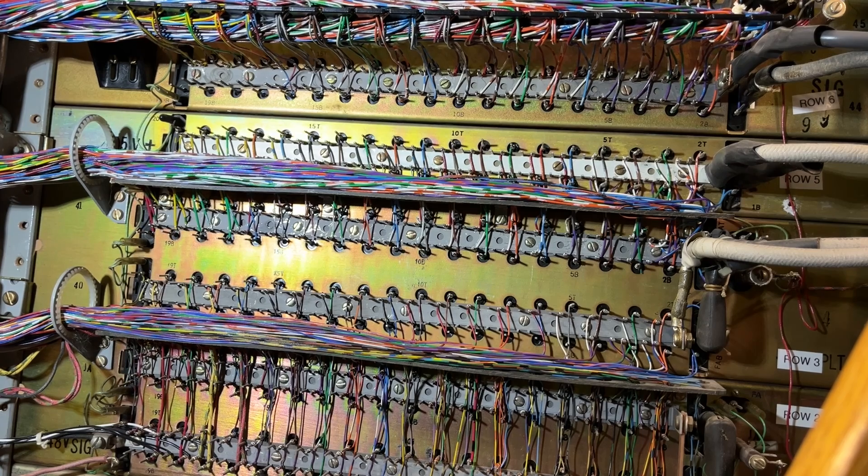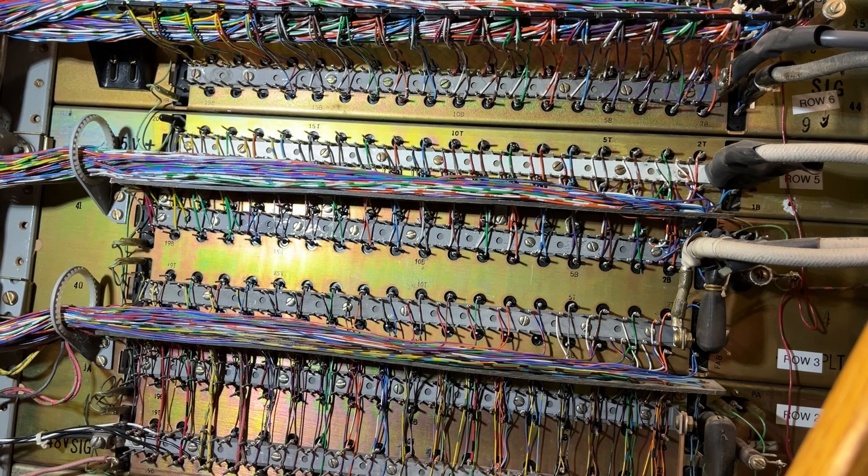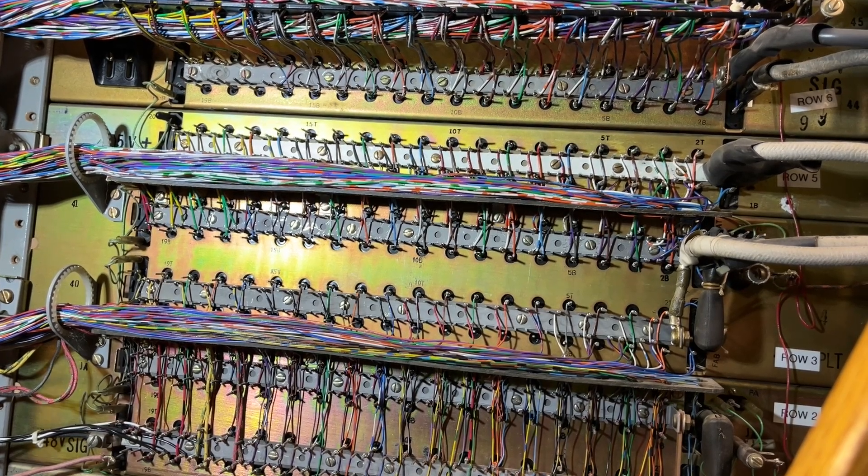There are some exceptions. If you're dealing with telephone switchboards — the cordboard type — they switch the lamp source off and on, so the lamps are all grounded: the bus is tied together and connected to ground. If you're involved in ringing, whether superimposed ringing or dry ringing, at that point that is switched. You normally don't wire ringing hot to something. In the case of a central office, it's at the ringing plant — it can be hot to your trunk if you needed continuous ringing for something, and again that's very specific to whatever the application is at that time.